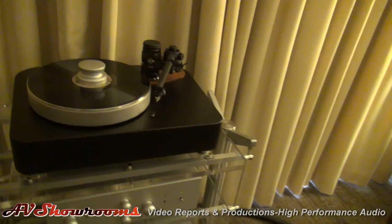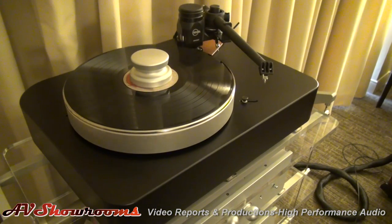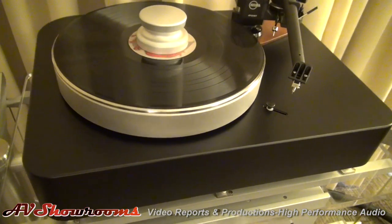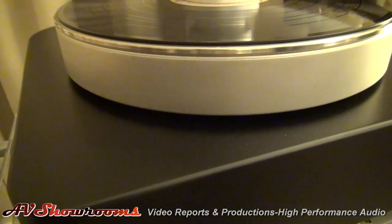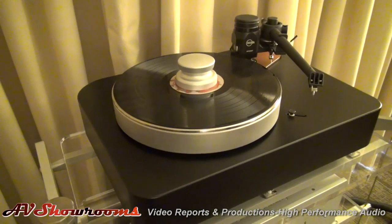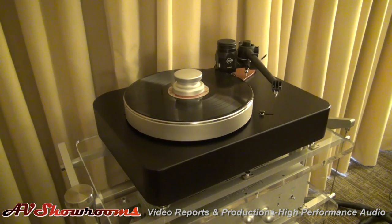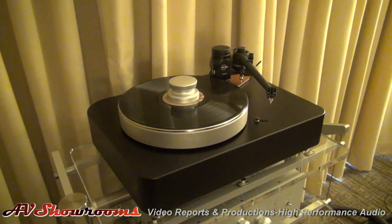This is a very custom piece, recently designed, and it's most closely related to our Acadies idler drive, which is based on the Swiss Lenco geometry. It is a vertical-based idler system and not horizontal, such as the Garrard and certain EMT models. The system retains the original geometry of the Swiss-made Lenco, but this is all housed in a precision CNC-milled aircraft aluminum, magnesium alloy, and stainless steel. That is a Panzerholz arm board as well, accommodating 9 to 12-inch effective length tonearms. This also features our modular platter architecture.